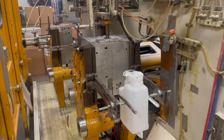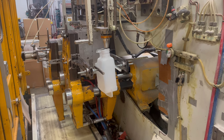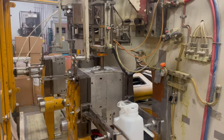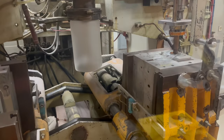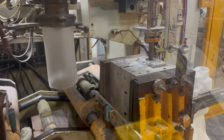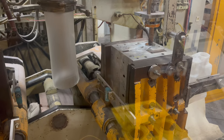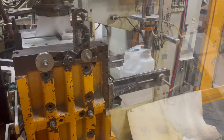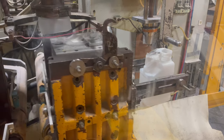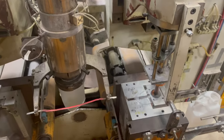You're going to see the mold open here in a second and reveal a newly finished jug. That's the way this process works — see the mold close around another piece of parison, it gets cut and goes back down into the station to make more. Let's move around the front so you can see head-on how this works. You'll see the mold open and then lift the part up just a little bit to release it, and it gets caught by those arms on the side to take it out of the way. Then the next time the mold opens, it'll get dropped onto the conveyor belt so it can get sent out of the machine and checked for quality.